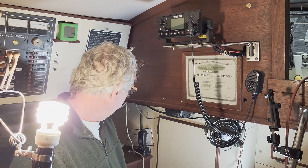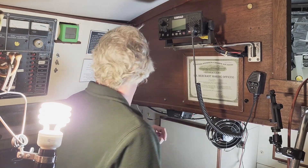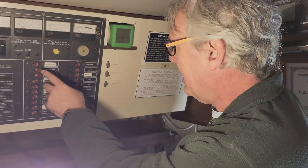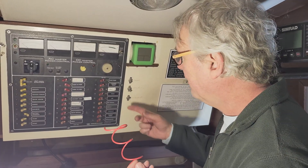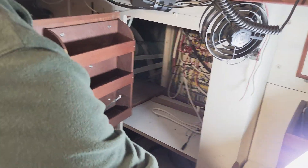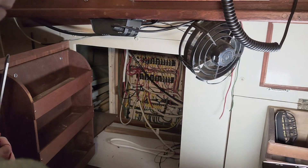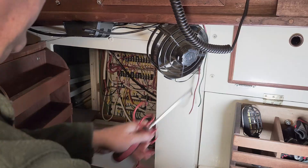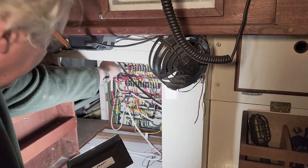Last time I was here I ended up pulling out about five pairs of zombie wires out of the electrical system and I cleared out a switch — which you can see over here is going to be one of these top switches. So I've cleared off a switch. We're going to open up this breaker panel and we are going to run a positive wire from the switch to the patch panel down in here. We'll connect that wire from the switch to the patch panel, and then we will connect this wire to the patch panel as well — this is the run that goes up to our power connection in the cockpit, which is what we are ultimately trying to complete today.